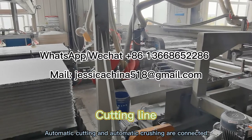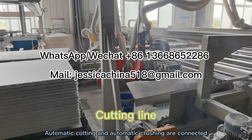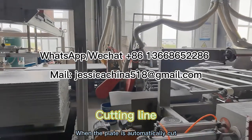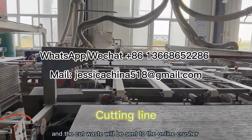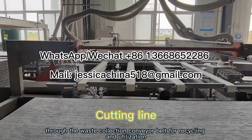Automatic cutting and automatic crushing are connected. When the plate is automatically cut, it will become the plate we want, and the cut waste will be sent to the online crusher through the waste collection conveyor belt for recycling and utilization. Therefore, our production process can be said to be waste-free.